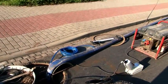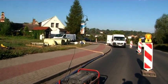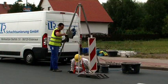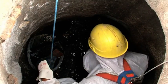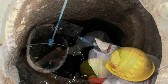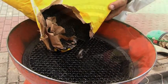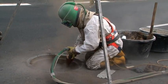Once all connecting sewer lines have been sealed, the demolition work in the old manhole can begin. Loose wall sections and channel elements are removed. The old cast iron ladder rungs are also removed.